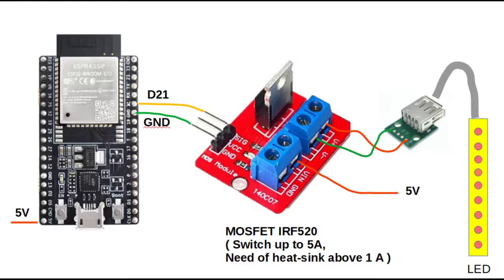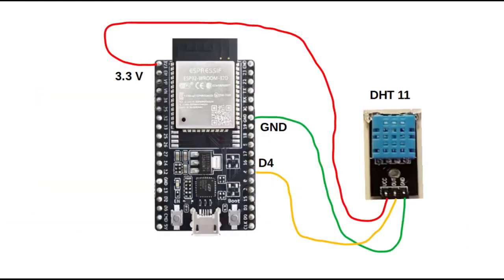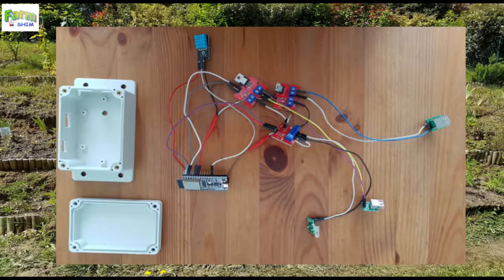The IRF520 switches the power for the LED light strips and fan with the outputs of D21, D22 and D23 of the ESP32 board. Here is the connection for the temperature humidity sensor DHT11. I connected 3.3 volts of the ESP32 to the power of the DHT11. Finally, I show you all physical connections for all parts here. In the next video, I will show you how to do coding to ESP32 with Arduino IDE.